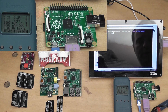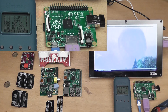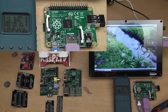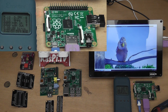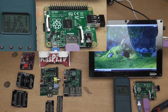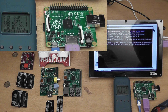Let's see what happens when you push the GPU — see if that uses more juice. 0.13 to 0.14, so 140 milliamps. I don't think that's going to change — we don't need to watch the whole Big Buck Bunny. The next thing to do will be to power it down, connect the camera, and see what happens when we use the camera, because that uses quite a lot of juice too.